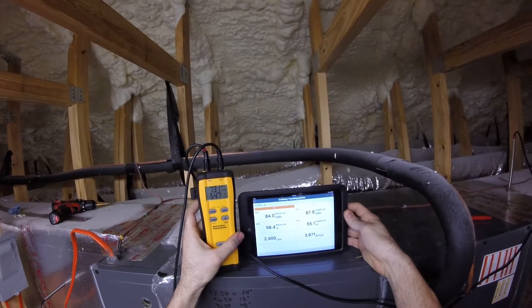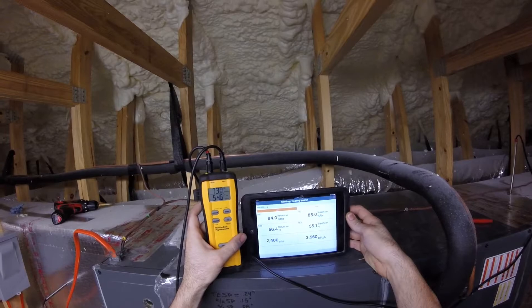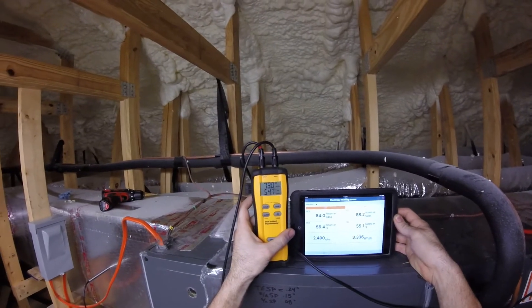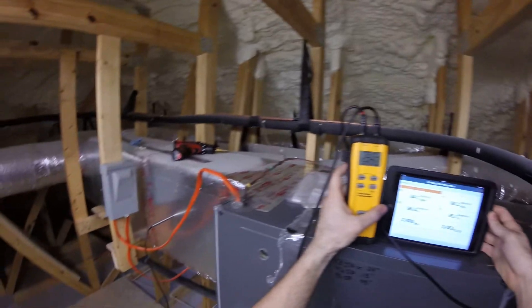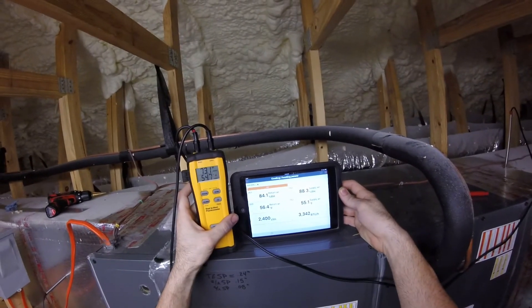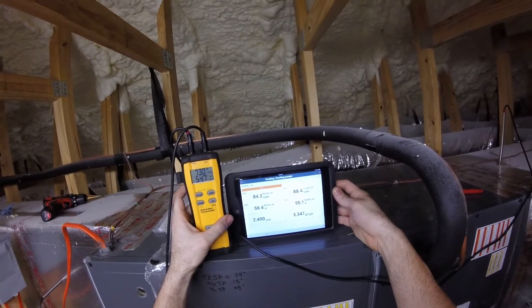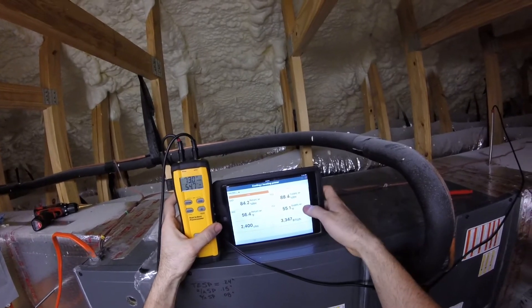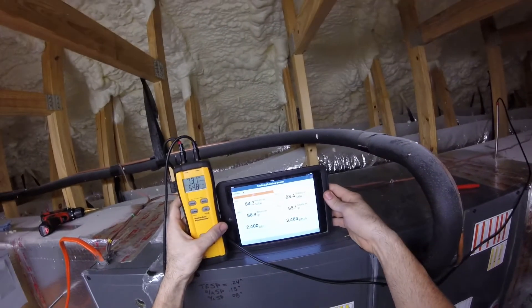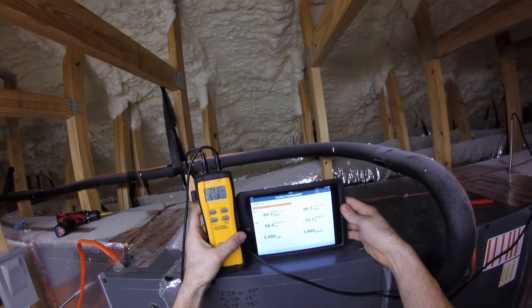To be honest, I'm really going to have to call this that the mixing does seem to change my reading — maybe I'm reading at most a half a degree warmer. I'm sorry, maybe I'm reading a half a degree colder when the air is not mixed very well, coming right off the blower. Right now I'm somewhere between 0.5 and 0.3. But my probe at the grill is over a degree warmer than my supply air in the trunk, and it's roughly a degree and a half warmer than the air in the supply plenum.